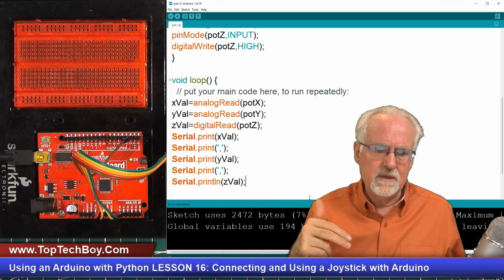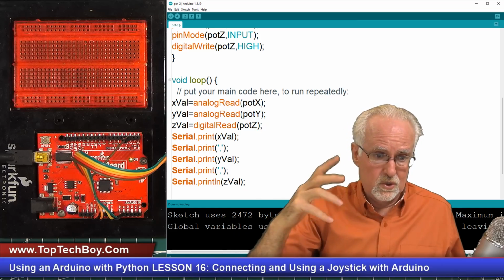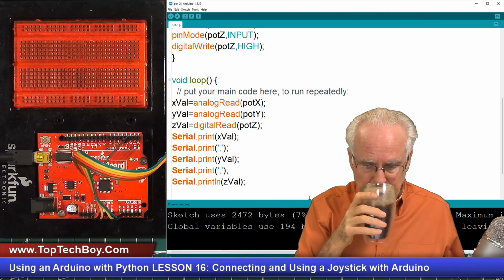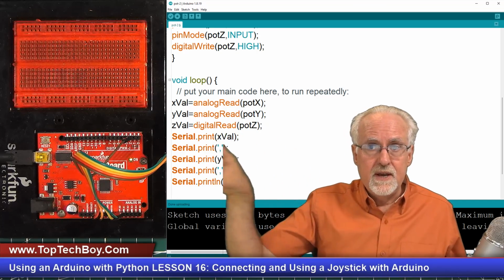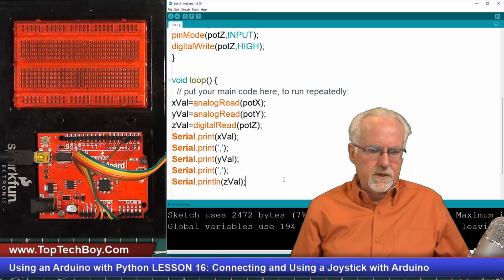No, I think that's coming this way. I think here just the println is going to work. It's when we're coming this way that we've got to be more mindful of the end of line character. Here, when we do the println, it's going to put the \r\n, and then when we read it in Python, we just strip those off. So that should work just like this.